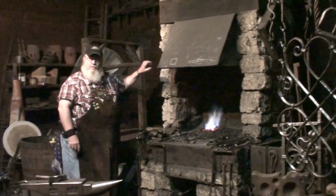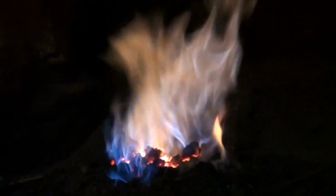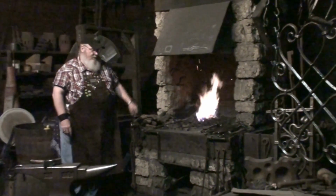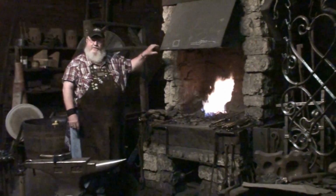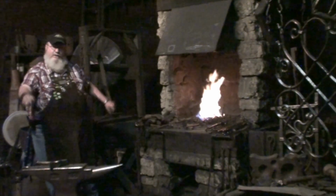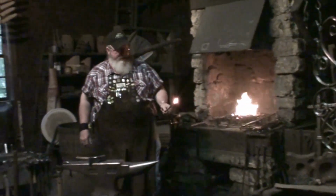The coal burns on its own from 800 to 1,000 degrees until I start pushing the air in. So it rapidly heats up, and you can watch like I do, watch the color of the coals. They'll go red, orange, yellow, white hot right in the center. Now, maximum heat in that coal has been measured around 3,800 degrees, almost 4,000 degrees. Well, here's my dilemma. That steel melts when it reaches 2,750. I'm at or above 3,000 in the fire, so it's really just a matter of timing how long you leave your steel in the fire for. And the story I'm telling you, it's my timing. Because now that I'm done my story, that steel's ready to come out and work.